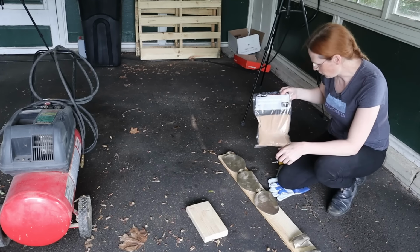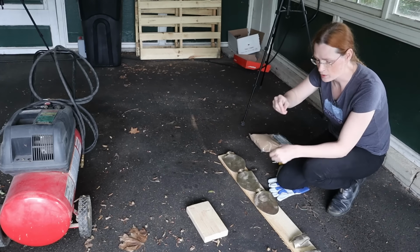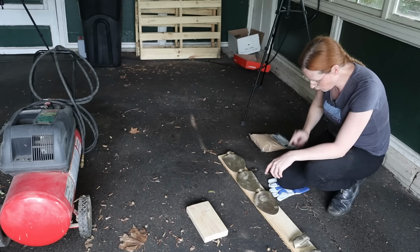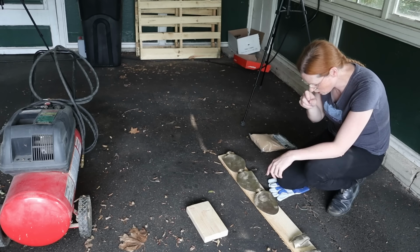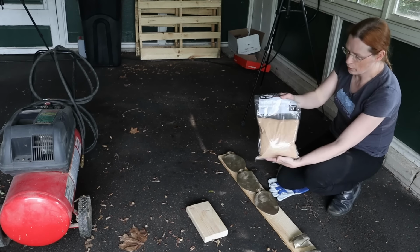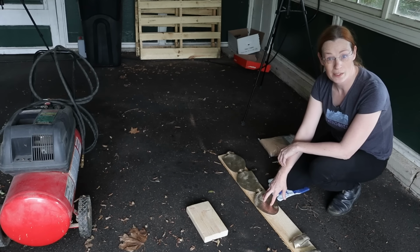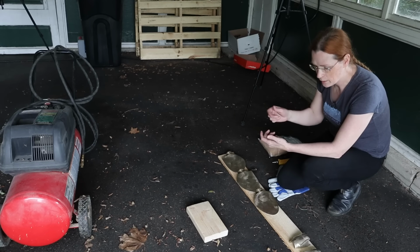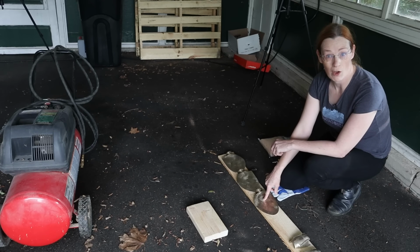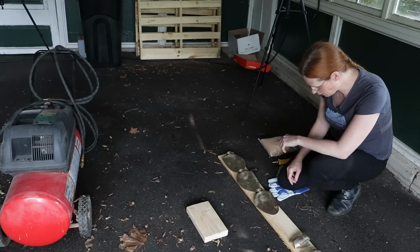The idea behind the walnut shot is that as it's shot in, it creates a whole bunch of little craters. It pushes the metal out of the way and creates a moon rock type effect, which apparently is a lot better for the epoxy to key into, and also for the primer that I put on afterwards. The idea behind using walnut instead of sand or glass, like you would normally use, is that, again, because bronze is soft, much like how I didn't want to use the brass-coated metal wiring, I don't want to take any material off. When I'm sandblasting, I don't want to knock any bronze off. I just want to reshape it so that it keys better for the epoxy.